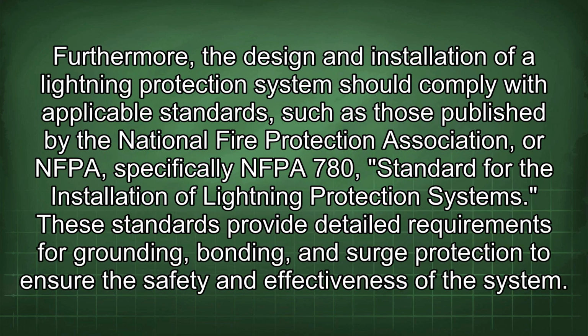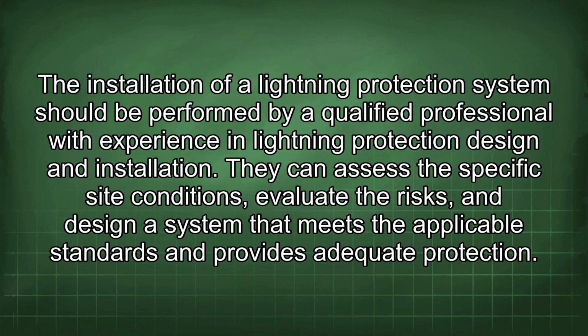Furthermore, the design and installation of a lightning protection system should comply with applicable standards such as those published by the National Fire Protection Association, or NFPA, specifically NFPA 780, the standard for the installation of lightning protection systems. These standards provide detailed requirements for grounding, bonding, and surge protection to ensure the safety and effectiveness of the system. The installation should be performed by a qualified professional with experience in lightning protection design and installation. They can assess the specific site conditions, evaluate the risks, and design a system that meets the applicable standards and provides adequate protection.